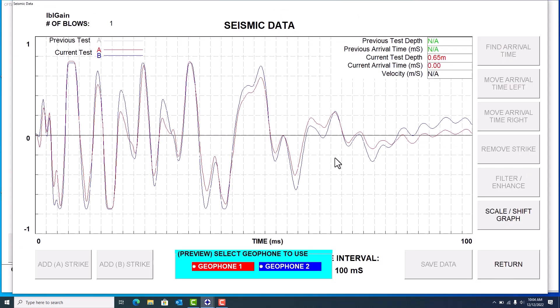It's going to record that seismic data and put it on my screen to preview. You can see we have two sound waves: a red sound wave and a blue sound wave. The difference between them right now is which geophone you're using. Your cone comes with two geophones unless you've requested one P wave and one S wave. In this case, this cone has two S wave geophones, as do most of our cones. The red wave is SGO1 and the blue wave is SGO2 — both are shear wave geophones.